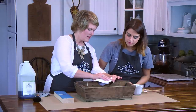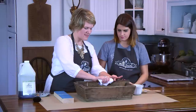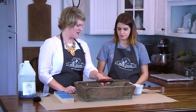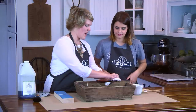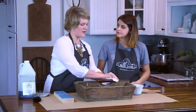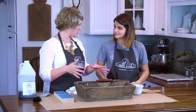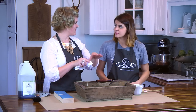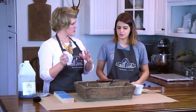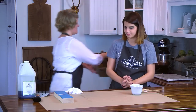You could even get more aggressive with this and really rub away the excess — it almost feels entirely dry, but it still doesn't take away from what we just did. It should not feel wet or sticky or anything like that after you do it. So that's how you can use it to revive old wood. You can apply it with a cloth, but I found it's best to apply it with a brush and then wipe away the excess.